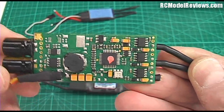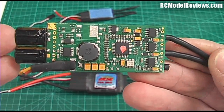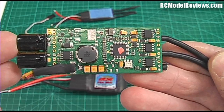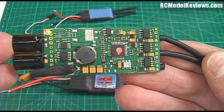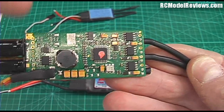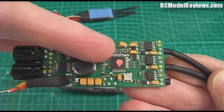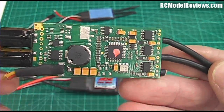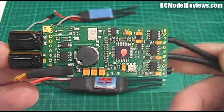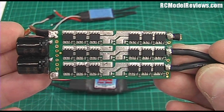There are also lots of other features in ESCs. Because they've got a controller chip, a little computer, they can have slow start, fast start, soft start. You can change whether they brake the motor — putting a load on it to stop it turning when you cut the throttle — or start slowing the motor down as your battery gets flat. All sorts of clever intelligent functions come from this little chip. Some people are now actually reflashing this chip so they can make the motors run in reverse, because it's a computer chip it can be reprogrammed.